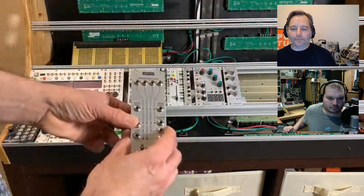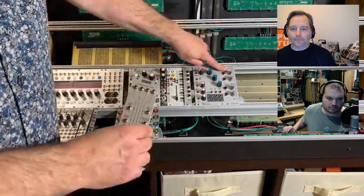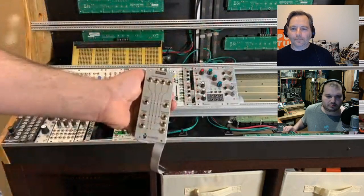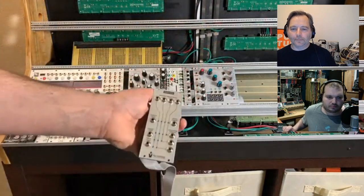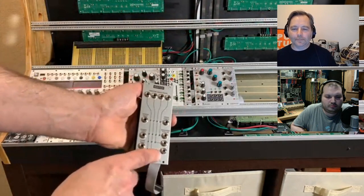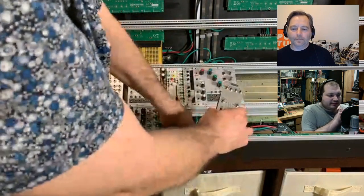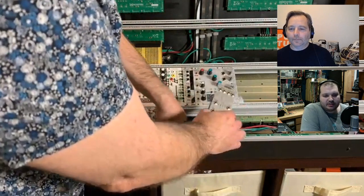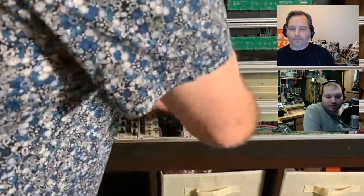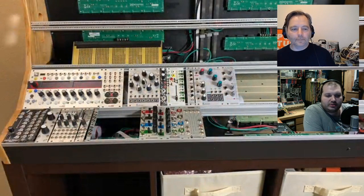I've played with a few of them. I had a LADDAC for a while that I really liked, but occasionally it would miss a clock coming into it unless I used a trigger delay to expand the width of the clock coming into it. I've tried to blow up the STG Sound Labs one, and I cannot get it to drop a clock. It's always dead on. And it has all the divisions available at once on separate jacks, rather than choose. Also looks like a great solution. Yeah, nice that they tacked on effectively offset generators that turn it into a sequencer. Some nice merging of steps, and yeah, the tree from Mystic Circuits as well is definitely one worth a look for people wanting sequential switches.